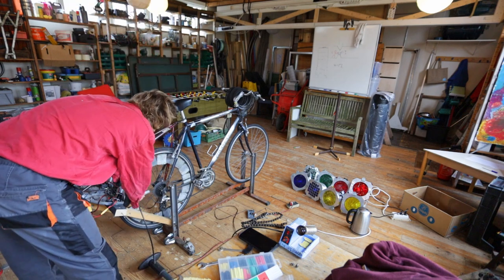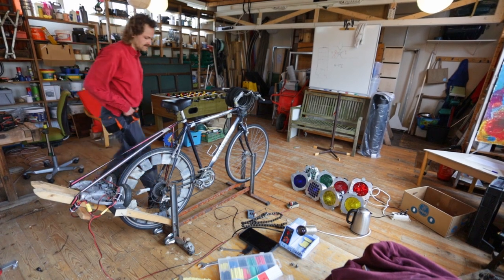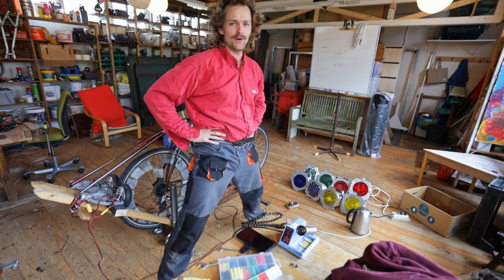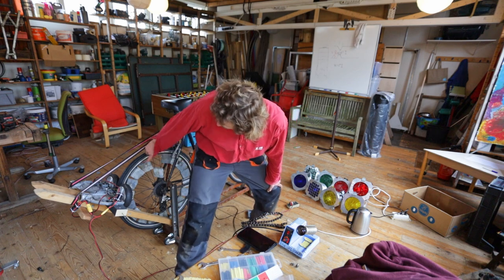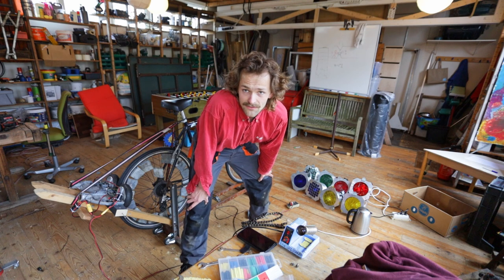I want to pump my bicycle up - more pressure. Next round: 70 volts, 8 amps. That's a new record - 560 watts. That is exhausting. There's a lot of energy lost in friction, so I think I'm going to quickly put the generators back onto the aluminum rim again and see if we can get an even better efficiency.